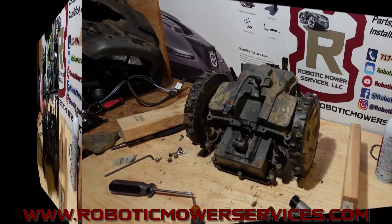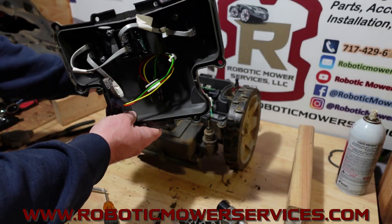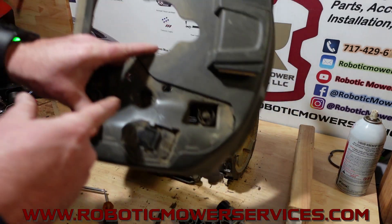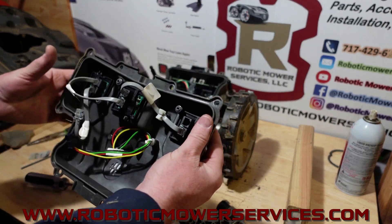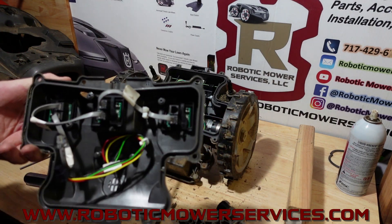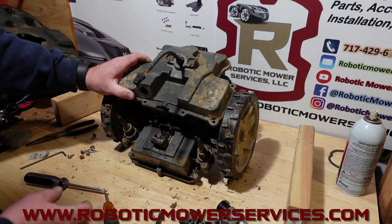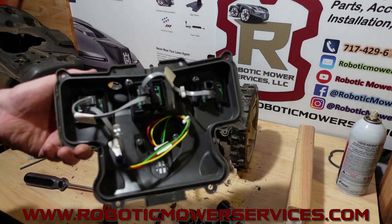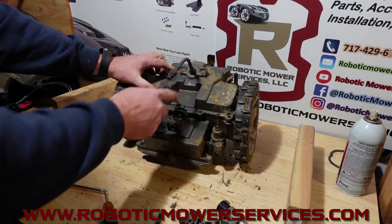The top cover of our AutoMower — when you pull this off you've got three magnetic sensor boards in here. In the body you have your magnets out here on the sides, and these magnets are going to move past these boards. The board is going to know whether the magnet is directly over top of it or not. Any time that the magnet moves side to side or front to back, the sensor board is going to know it and tell the mower hey, we've got something going on — there's a collision, or something just hit us from the side. If you have this sitting here with the front of the mower coming out this way, you might say well what's this third board for?